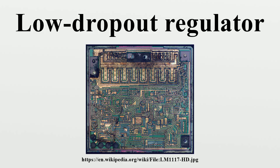Two specifications that should be considered when using an LDO as a filter are power supply rejection ratio and output noise. Specifications. An LDO is characterized by its dropout voltage, quiescent current, load regulation, line regulation, maximum current, speed, voltage variations in the output because of sudden transients in the load current, output capacitor and its equivalent series resistance. Speed is indicated by the rise time of the current at the output as it varies from 0 mA load current to the maximum load current. This is basically decided by the bandwidth of the error amplifier.